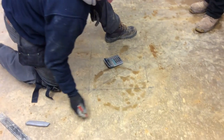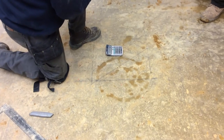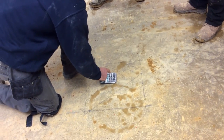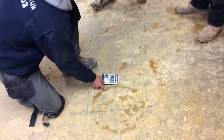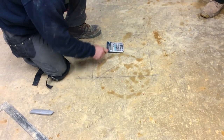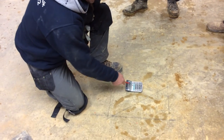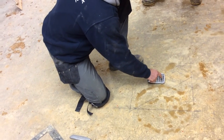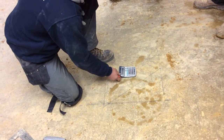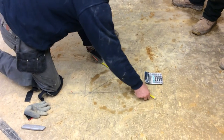Plus this multiple — times by itself. Looking at the calculator: 440 times by 440 equals that. If it was a rectangle, this multiple would be different, so we'd have to write that down and add it to that. But it's a square, so it's going to be exactly the same. So I'm going to times it by two, then take the square root. As you can see, it should be 622mm diagonal.